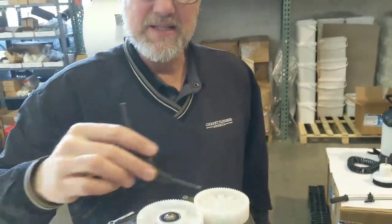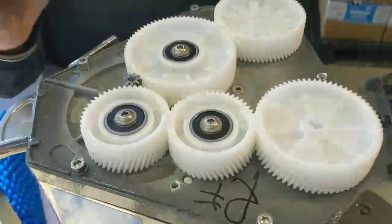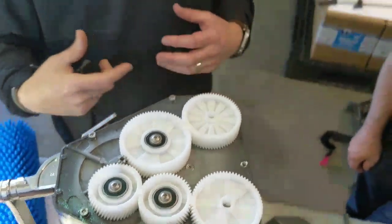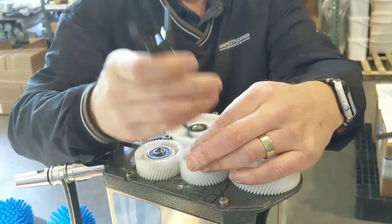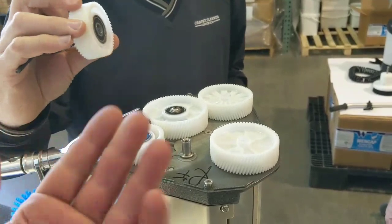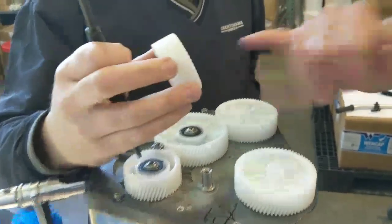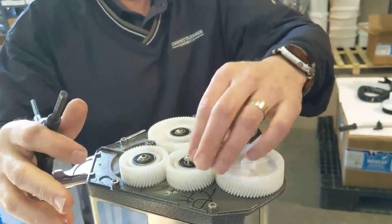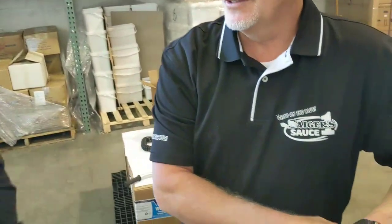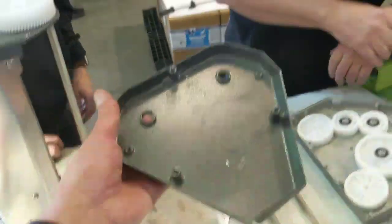As you can see, these are plastic gears, but this is a very durable polymer associated with handguns and things of that nature. There's a little white lithium grease on there — and sealed bearings throughout. We have a different way of actually replacing a gear on these main gears; you can typically just pop it off. These gears are pretty robust — rarely do you have issues with them. I had the original 10-inchers for nine years and never had a gear problem. We finally just wore it out from using it so much.